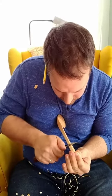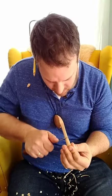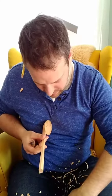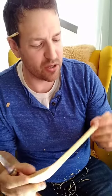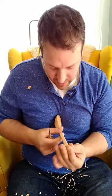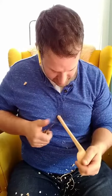I've basically got that the way I want it — facets on both sides of the handles now. I like to do these thin little shavings off of the sides of the bevels — for scoops and eaters I do it; with cooking spoons not so much. Those are the ones you feel, and for some reason they feel sharper than the ones on the back face. So those are the ones where I take it off. On the back sometimes you can get away with coming this way, but sometimes you've gotta turn it around and roll with it that way — you just gotta feel what the knife is willing to do.